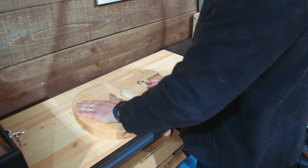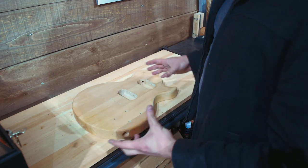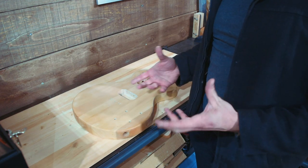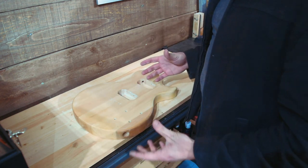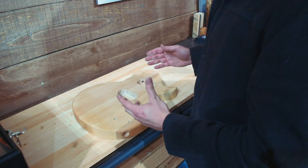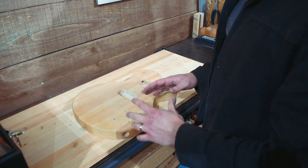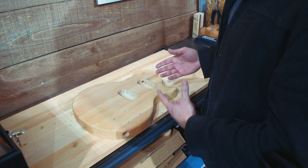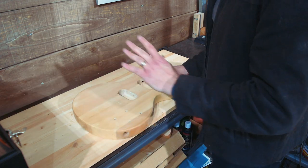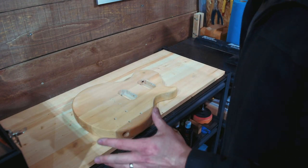Belt sanders are too aggressive for your final prep sand on wood, and they're definitely too aggressive for sanding a finish. I've had at least one person comment that it doesn't matter what sander you use, it's all about the grit — that's not correct. The motion and speed of the sander makes a difference. A belt sander, even with 1500 grit belts, is going to create too much heat because of the way it works and will mess up a finish. Similarly on a project like this it can create problems, so make sure you're choosing the right type of sander.